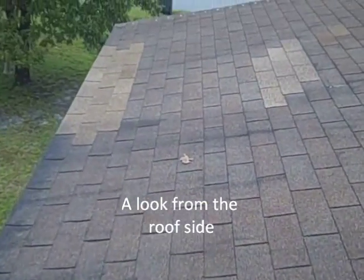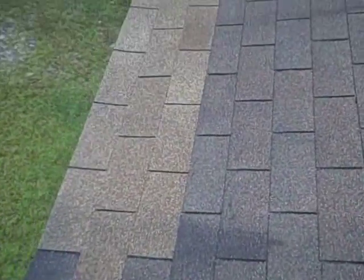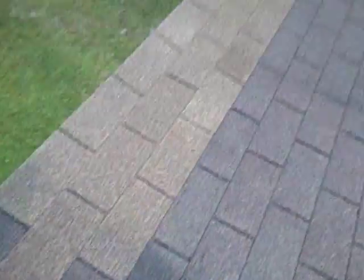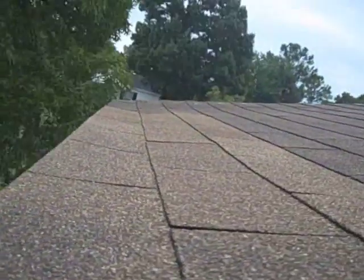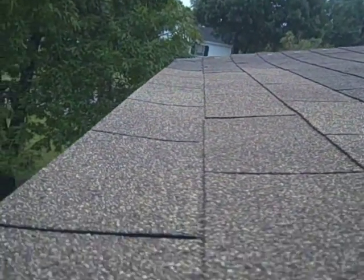Oh, we're on Trout Street here in Supply, and ran across this problem several times on these single wide shingled mobile homes. What they do is they get their fascia board out here. This is the fascia board, and what this does is it comes up a little bit too high, and if you notice right down through there, what it creates is a dip in the roof.